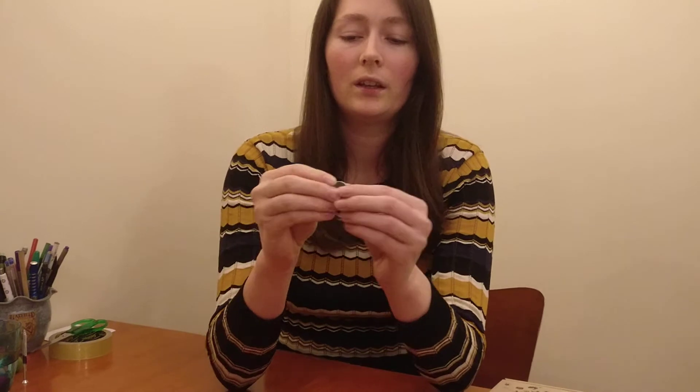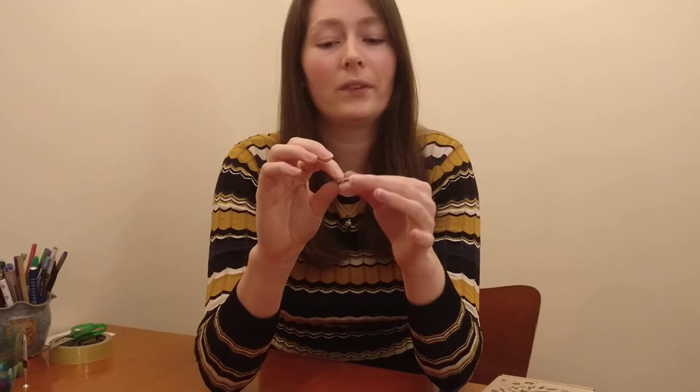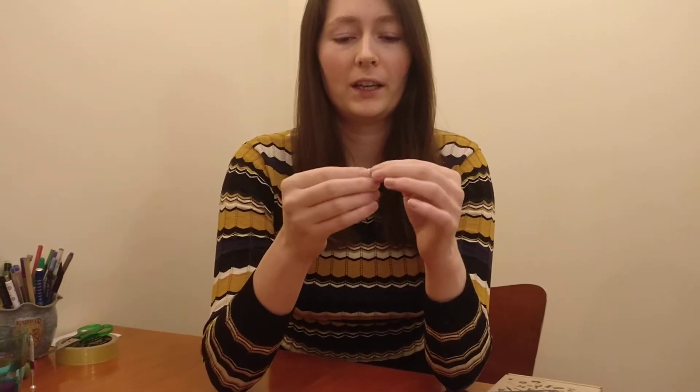I had a look and found that for a pack of 10 of these magnets you'll pay about £4. This size is 15 millimetres by 2 millimetres and it worked really well for this challenge. I tried it with the same shape magnet but a weaker one — the type you'd find on the back of a fridge magnet — and it just wasn't strong enough to hold up the weight of the screw. So you really do need one of these neodymium magnets. When working with them, be quite careful because they are strong and it's easy to pinch your skin if they suddenly ping together.